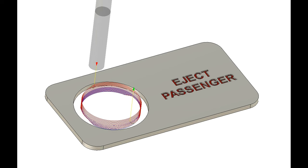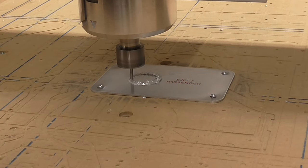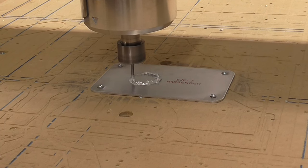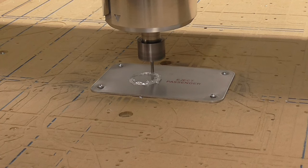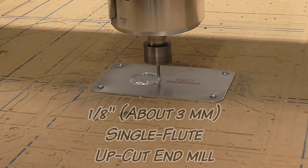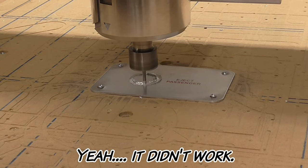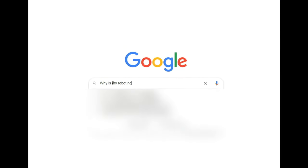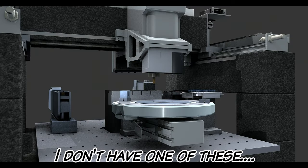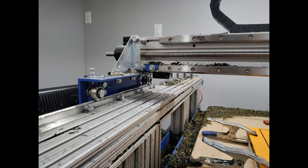With the text done, I was able to start working on the button cutout. I usually use my CNC router to cut wood and plastic, which are fairly forgiving materials. But it's been a while since I cut aluminum on this setup. My first attempt was with an eighth-inch single flute upcut end mill, and it ended in disaster — all it did was turn the aluminum to goo, push it around, and gum up my part. Speed and feed calculators on the internet aren't any good in this sort of situation. Those guidelines assume a high mass, high rigidity machine, and my rig is made out of aluminum extrusion with V-groove bearings, so I need to figure out my own parameters.